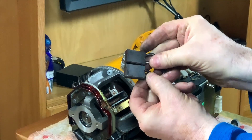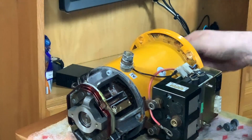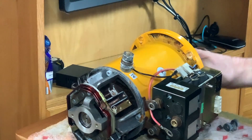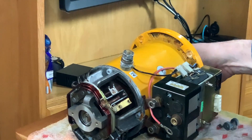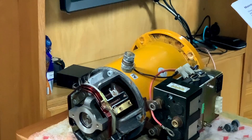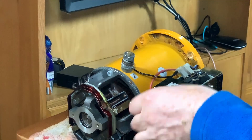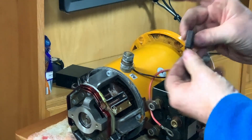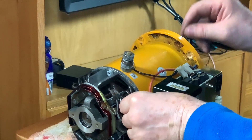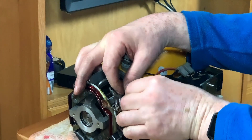I think there was a minimum measurement — I'm sure it was 14mm; I'll look it up again in a second. Just having a quick flick through. No signs of any burning on the commutator. Looks to be all okay in there. Those first two don't look bad to me; everything seems to be in situ, and they're sliding reasonably well up and down the box, so theoretically that should be able to go back in.